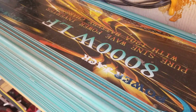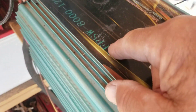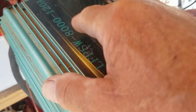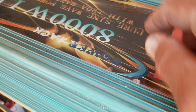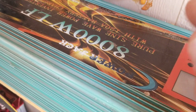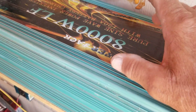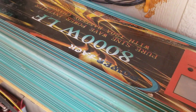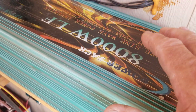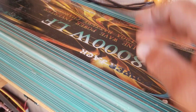First thing — I've asked you a couple of times and haven't got a straight answer yet — are you sure you have pure sine wave? It'll be labeled LF, which is low frequency pure sine wave. Make sure you have the pure sine wave. If you have modified sine wave, you will have problems with computers and electronics.